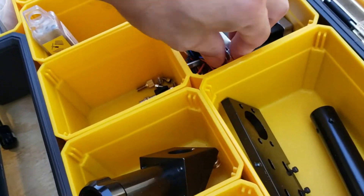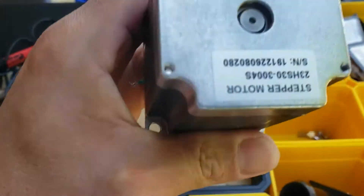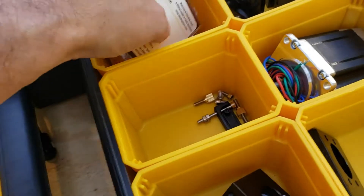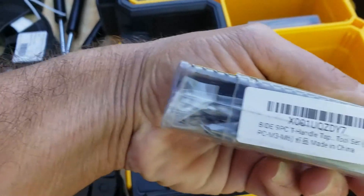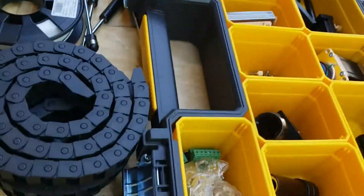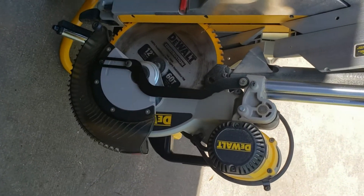Here's a NEMA 23 motor — I got this one from Amazon through Stepper Online, I think I paid $37 for it. I haven't tested it, we'll see how that goes. These are the mirrors I'm using from Cloudray. Tap and die set from Amazon — $15, and that thing came in like a day, it was crazy. For early on, I would get the T-handle Allen keys, because you're about to tighten together probably like 600 little screws, so the T-handle is going to make it a lot faster. You've got to have a chop saw to chop out the aluminum for sure.